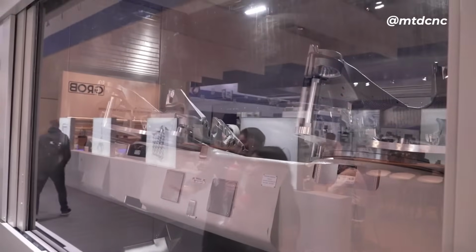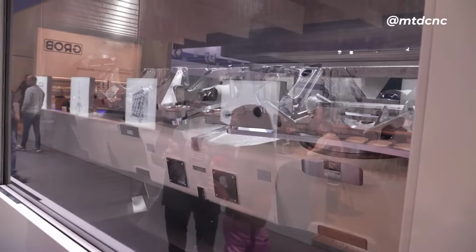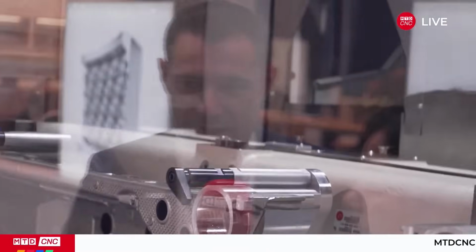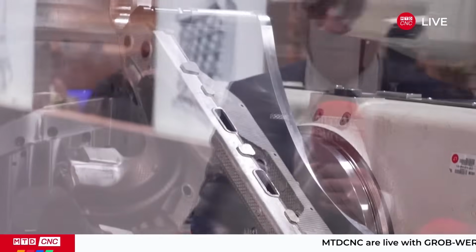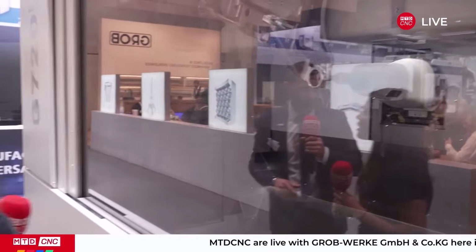So what we can do here is gigafactoring parts in regards of gigacasting: big frames, battery housing, stuff like that, which we are using for bringing the electricity into the car in the end. Which materials can we work here? Mainly aluminium. That is mainly what such parts are made out of. For sure, there's also the possibility to work with steel with this kind of machine. That's also possible, but mainly it's aluminium.